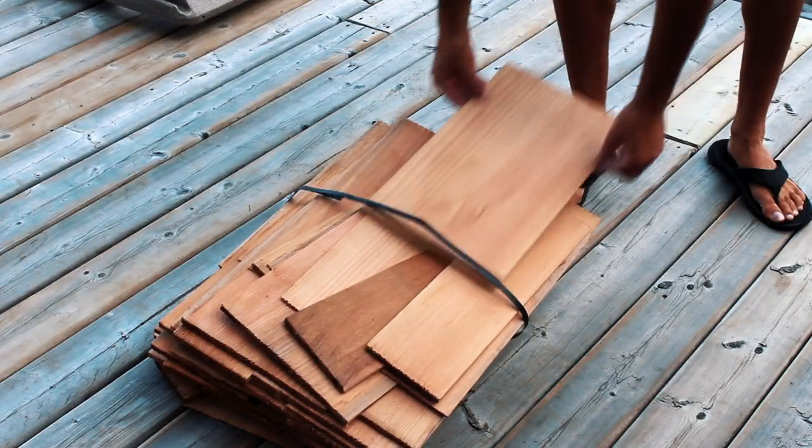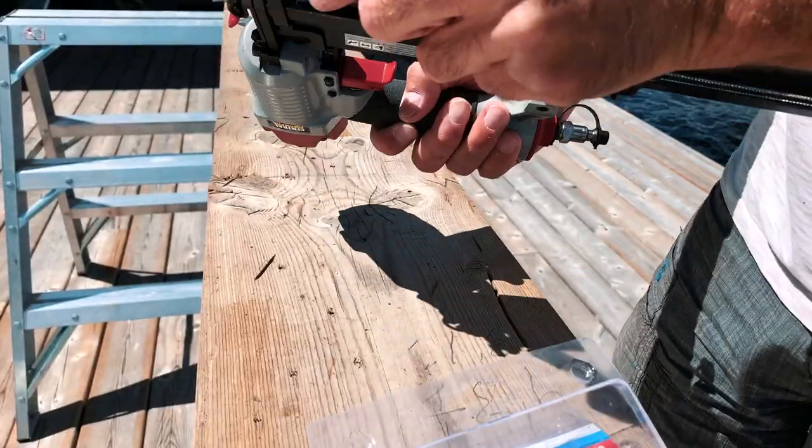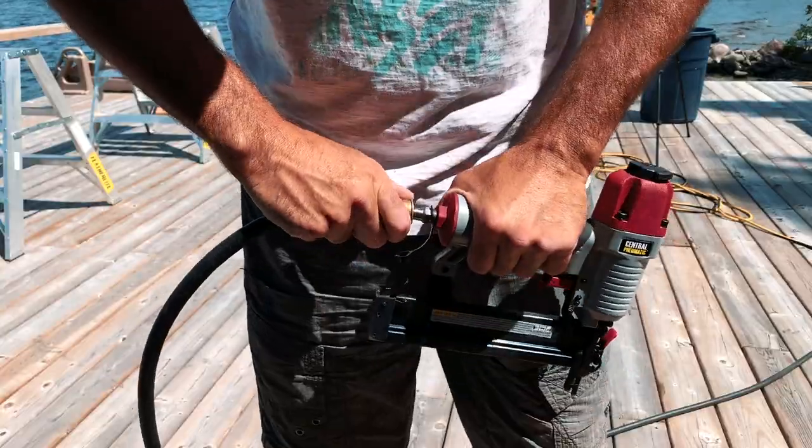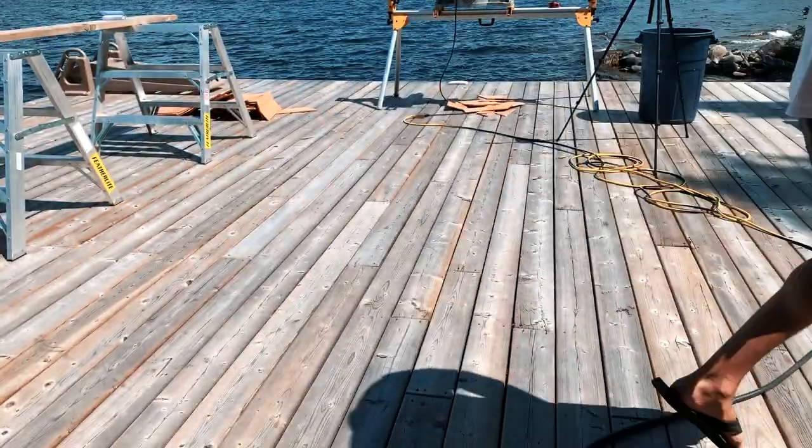For the cedar shakes, I'll be using natural Western red cedar. I'll leave a 7-inch reveal between rows. I'll secure the shakes to the wall with 1-inch long narrow crown staples, and I'll be sure to staple above the 7-inch reveal line. I'll make sure that the seams don't overlap, and I'll double up the bottom row to prevent water penetration.